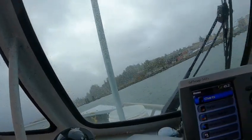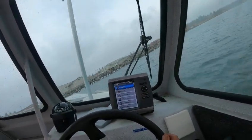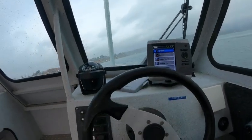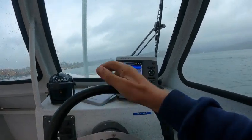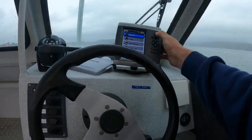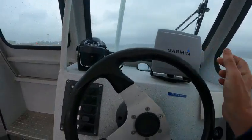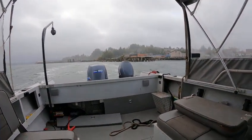I'm going to have to move your steering torque pin about a quarter inch to the right, because your wheel's taking off to the right when you let loose of the wheel — and that will eliminate some of that. All right, this is Dr. Al — gotta shut it off for fun. Hey, you passed the boat test — good job, guys!